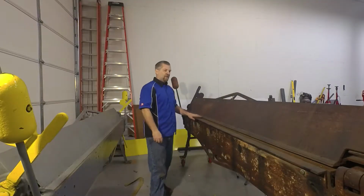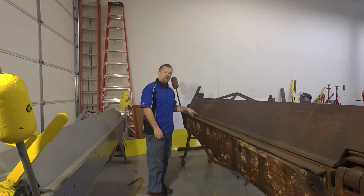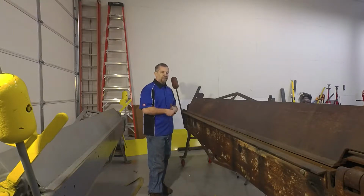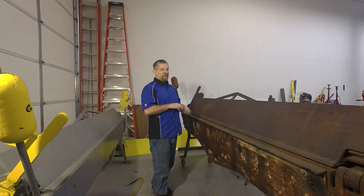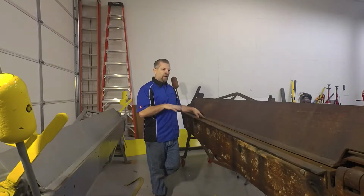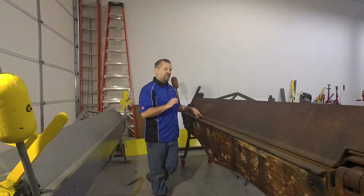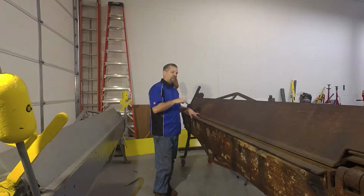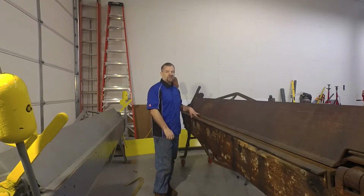I want to go back to this edge, which I think they call the nose. So I'm going to call it the nose from now on. Maybe it's wrong, and we'll readjust. This is a model 816. The 8 stands for an 8 foot. The 16 means it'll be in 16 gauge mild steel. And on that note, if it's 16 gauge mild steel, it usually will be in 14 gauge aluminum, and then it'll be in 20 gauge stainless. So it's 2 gauge thicker from mild steel to aluminum and 4 gauge thinner from mild steel to stainless, a rule of thumb that's on their website and from what I've researched.